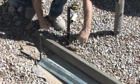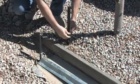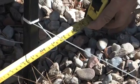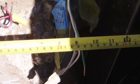Next, attach a second string line to locate the slider guide. The second string is 12 inches behind and exactly parallel to the first string. This 12-inch relationship is crucial to be sure the gate tracks properly. Locate the position of the slider guide, which will be centered within the 4-foot back frame area. The face of the first post will go 9 inches beyond the gap opening.